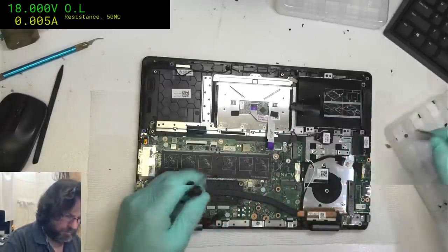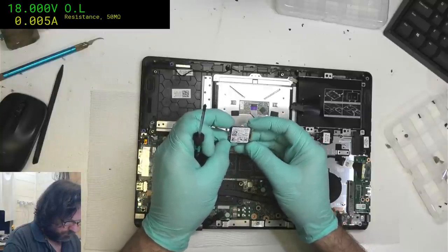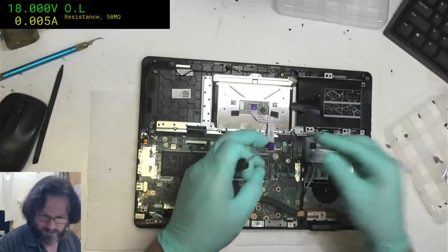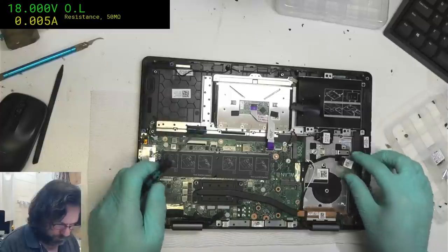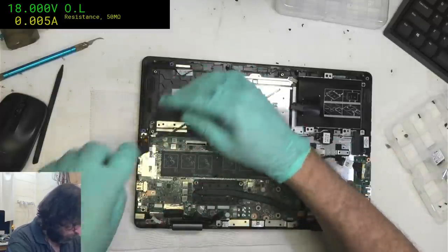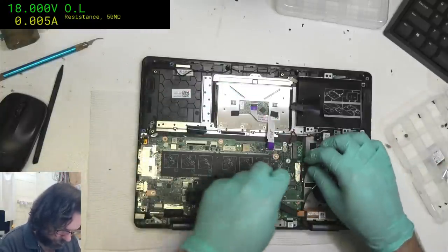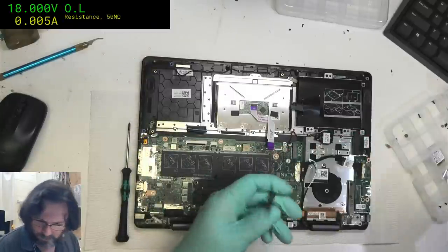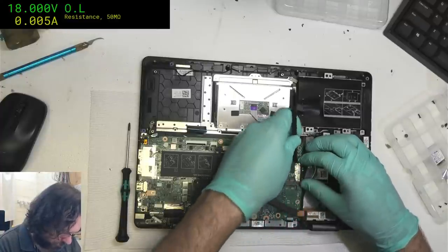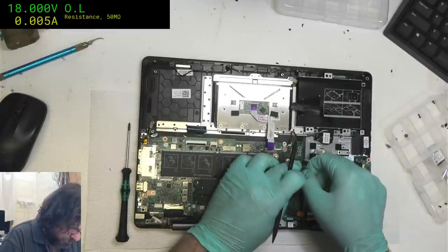No, they're not like Optane. These are genuine SSD, you know, M2, or is this the PCI? Yeah, this is a PCI Express Gen 3 X2 NVMe. But I do wonder about how the actual storage module holds up. Just seems like a little bit too packed in on one chip. Considering that's a, what is that, a 256? That's a 128. I've got another machine that's got a 256 gig on it. It just feels like something's got to give.